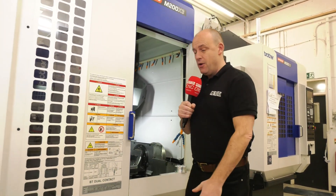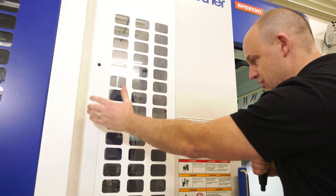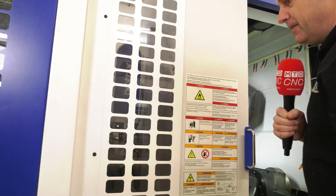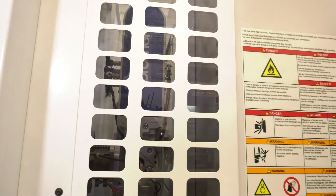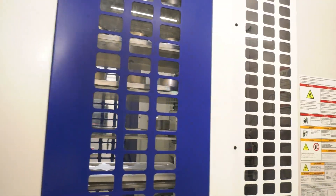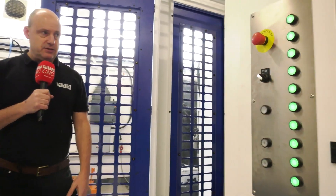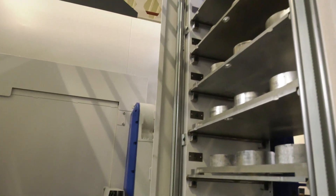That's just the machine. More importantly, keeping that spindle running — they have a unique automation system here, which is just 300 millimetres. This robot, in such a compact footprint next to the machine itself, can be loading the machine from this system here. This is a BV7870 loading system with 10 pallets stacked with billets. These billets can run through the night; the machine can run unmanned over the weekend, meaning the spindle is turning continuously, all at that reduced power consumption.